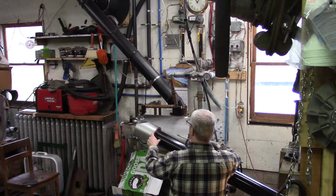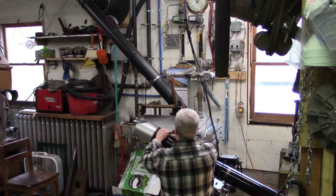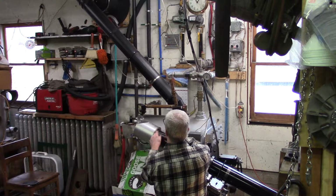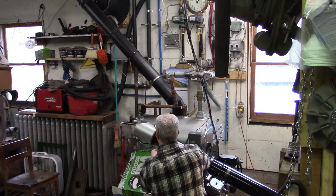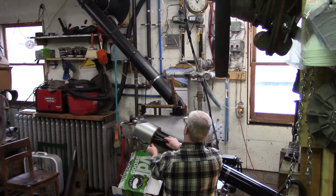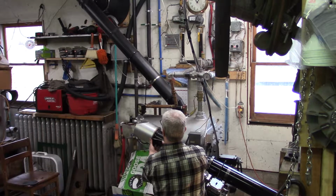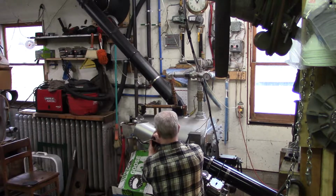It'll be interesting to see the packing ring in here, because the packing ring actually isn't very old. Well, this is December of 19. It was October of 18 when we fired it up with a new packing ring in it. I would expect, well, hope that the packing ring didn't get all buggered up, but maybe it did, because these brasses are a bit more worn than they should be.